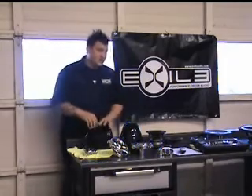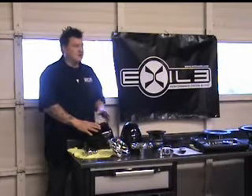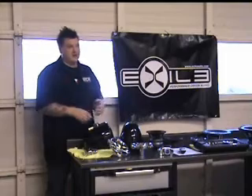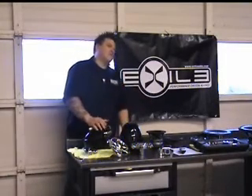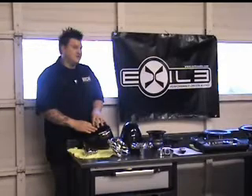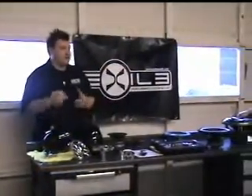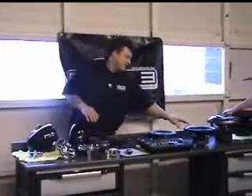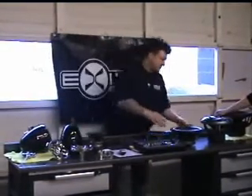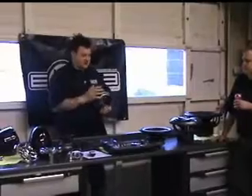As you get into system design on a marine product, besides making sure you have enough power for the tower speakers, you also want something for the sub. A sub isn't just a magical thing you throw an amp into and it's great. You have to match impedance — what the woofer can handle with the amplifier and what the amplifier can put out. For example, you might have a dual voice coil sub. Some drivers are single voice coil, and some manufacturers make both configurations — let's talk about voice coils.